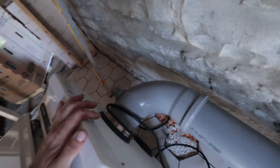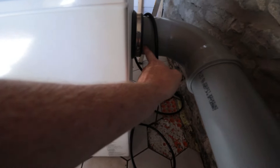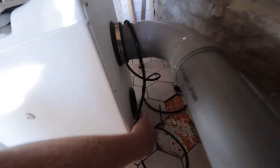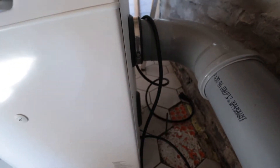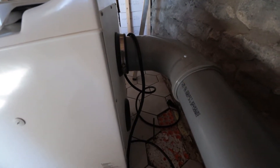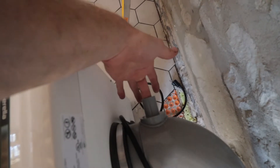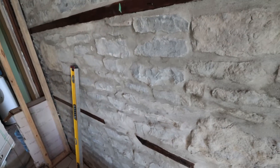Here's the venting. Out here we're going to come up. This is the fresh air intake, so this one we'll just send down in the basement and grab some fresh air. We chose the electric model, so not a huge deal. We then have our condensate plug, so any condensation that builds up in here we'll vent downstairs to our sewer.